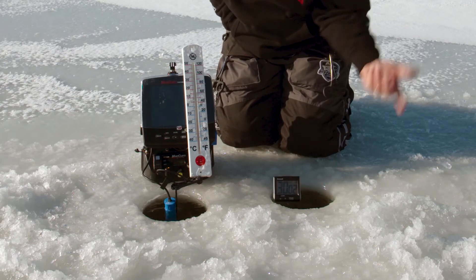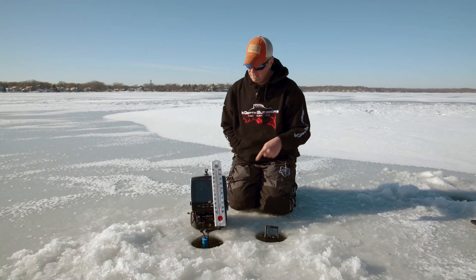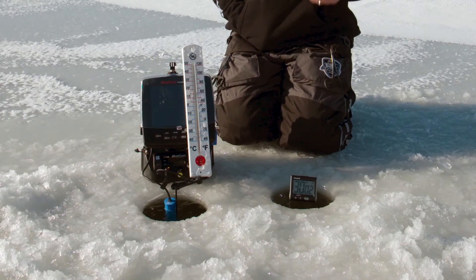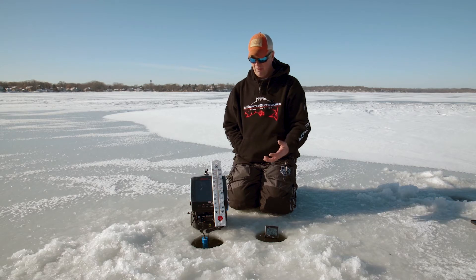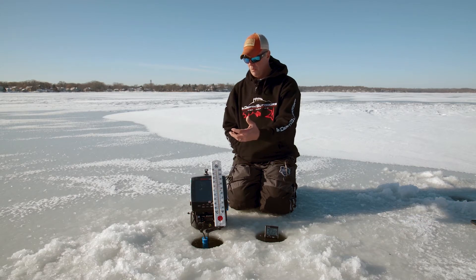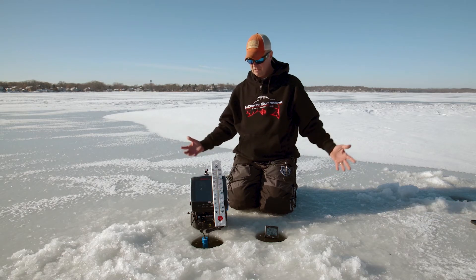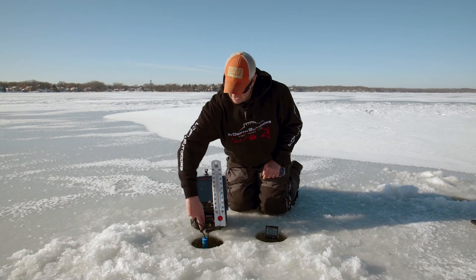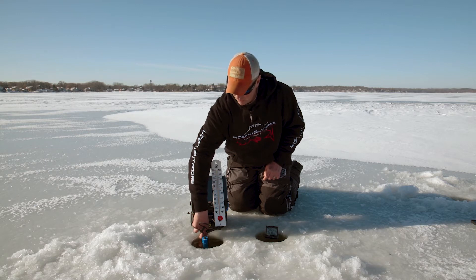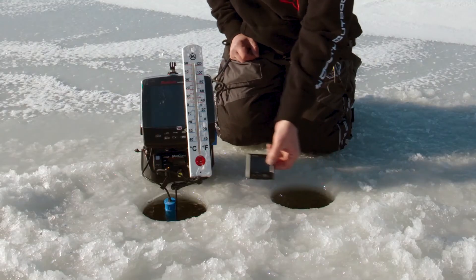On the other side — that'll tell you what you need to know. Not the greatest. The temperature here stayed right in that seven to eight degree range, not a lot of wind or blowing snow today. Obviously if snow is just blowing into the hole that's going to be an issue, but the Ice Defense unit is working so well it's actually starting to undercut the edge where the water volume is coming out of the tube. Pretty impressed. We're going to run a second test — drop an air stone in the other hole and see how it compares.